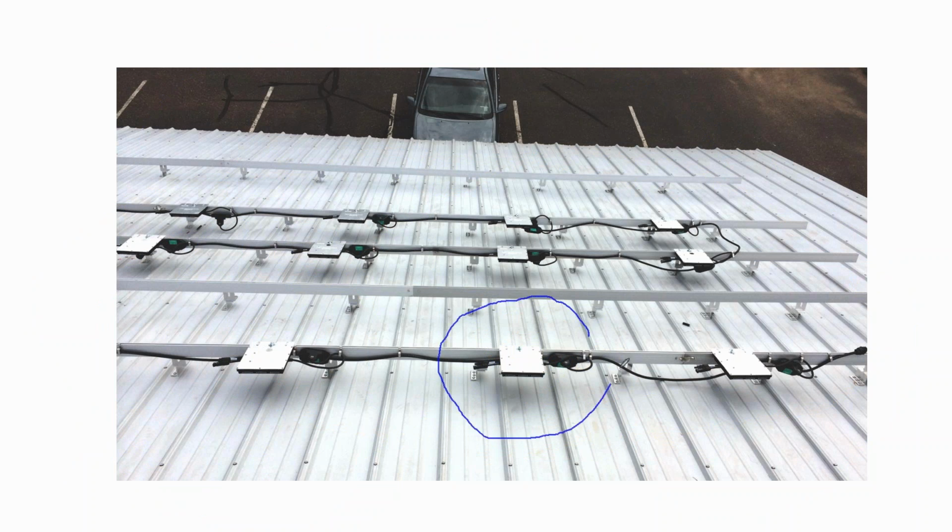And my solution is to tell the customers, look, we're not going to replace a single microinverter. We'll have to wait until 4, 5, 6 of them fail before it's worth anybody's while to go out and maintain it. And while that might make sense on paper, I've never met a client who is satisfied with 98% of their array working. They're going to get an error message in their email saying that this microinverter is offline, and they're going to want it fixed. They want to see 100%. And so sometimes this level of granularity, while it does have some advantages in terms of operability of the array, can result in increased maintenance costs.